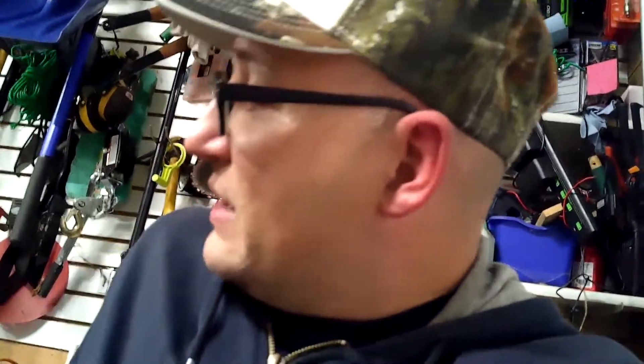One other thing I noticed: the pulley is bent. I'm guessing I did that trying to pound it on there. I'm just going to let her roll right now because I've got no other options. I'm going to eventually purchase another pulley, take this one off, and put the new one on properly so it doesn't bend. That probably means whenever this one starts creating problems is when I'll do it. That's probably why the belt's flying off — but it's also that the belt is really loose without the guards on it. Just one successful test — that's all we need.